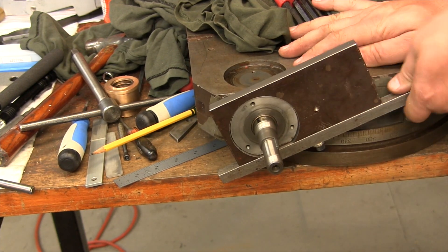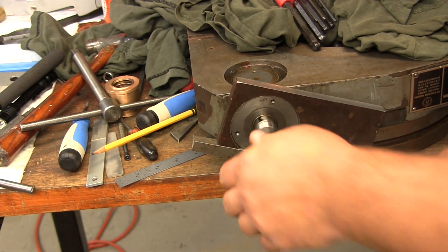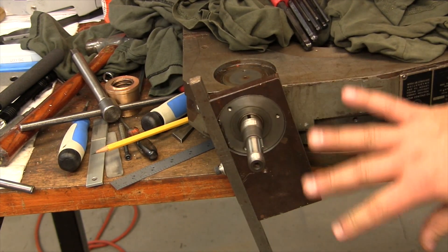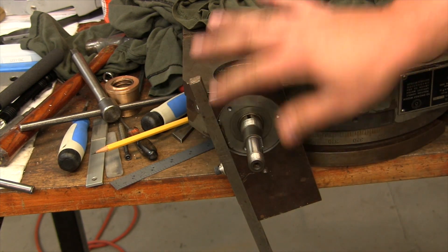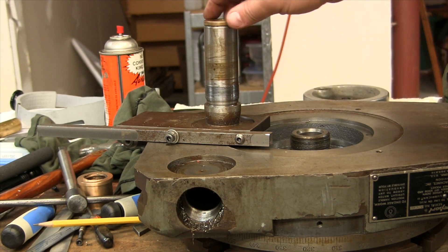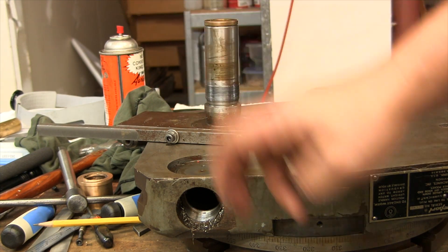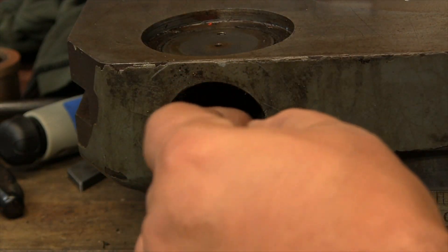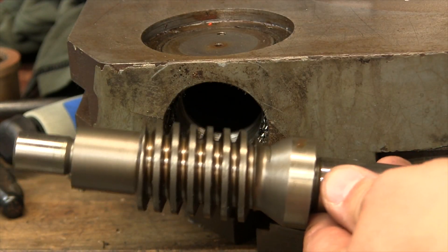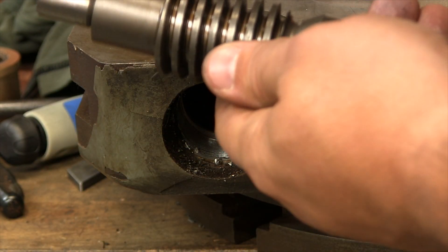This is sluggish, so I'm going to make sure I don't have any set screws holding it in place or anything like that. Doesn't it always happen that way — you shut the camera off and you play around and things get taken apart. So this was just a fine thread and it came right out. Now you can see all this wonderful gunk that's in there. Here's the worm — she just slid right out beautifully. This thing has no wear on it.